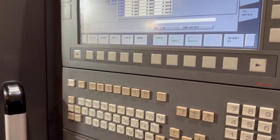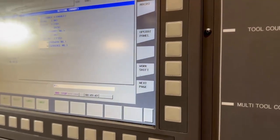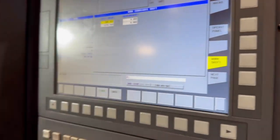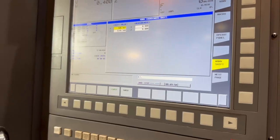Press the offset button again and you should see the work shift button down in the lower area, which takes you to that screen. You've got to be very careful with this screen because you can accidentally change the figures — that's why I've put that 548 up there, so if you accidentally change the X you can put it back.